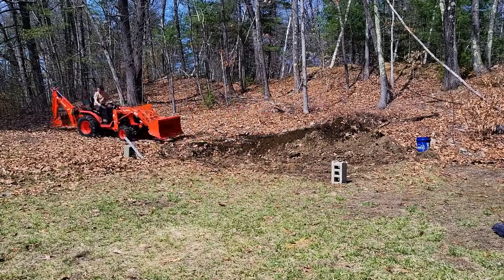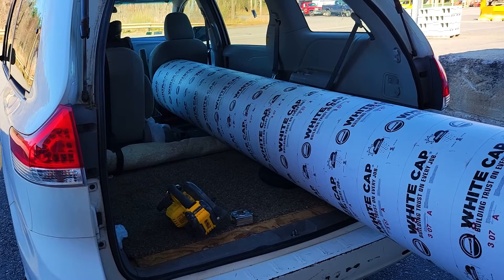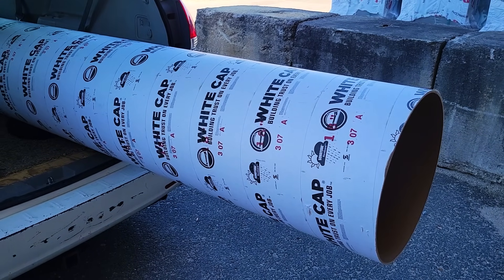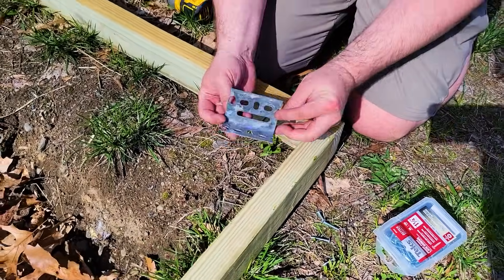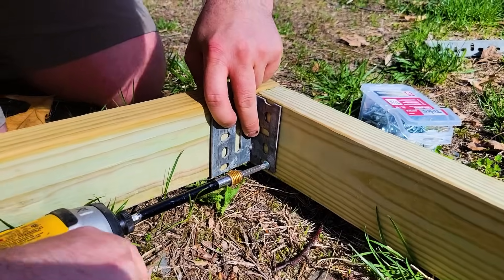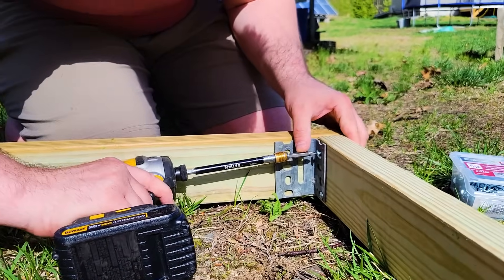For my footers, I decided to pour concrete on site. So we're going to have to set up forms to contain the concrete and keep it from spilling out. I purchased some sonotubes, which are large cardboard tubes designed to hold concrete in place. And I decided to screw together a large 2x4 frame to hold the tops of all these forms together, so that they're all level at the top and they're not going to shift and move around as we pour the concrete.